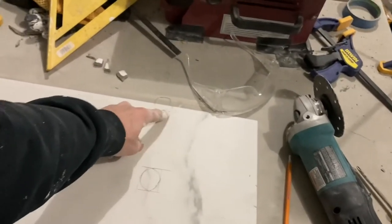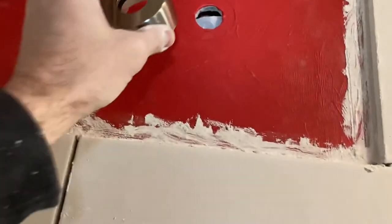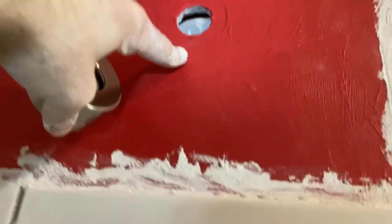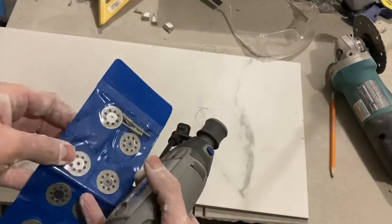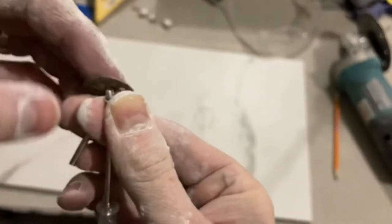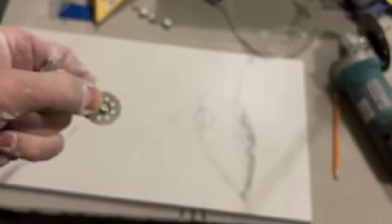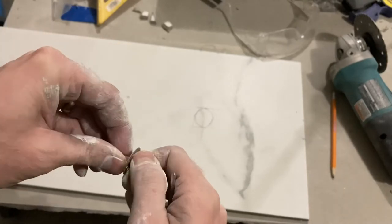The next cut we're going to do together is a much more difficult cut — the hole for your shower arm. You can see that's a much smaller diameter. Transfer the measurements over to your tile, then take out your escutcheon cover for your shower arm and make sure you have that line accurately marked on your tile as well. So you have your ideal cut line and also your do-not-go-outside-of cut line. I'm going to be using a Dremel tool with a diamond wheel on it — I'll pop links below for all the tools in this video.